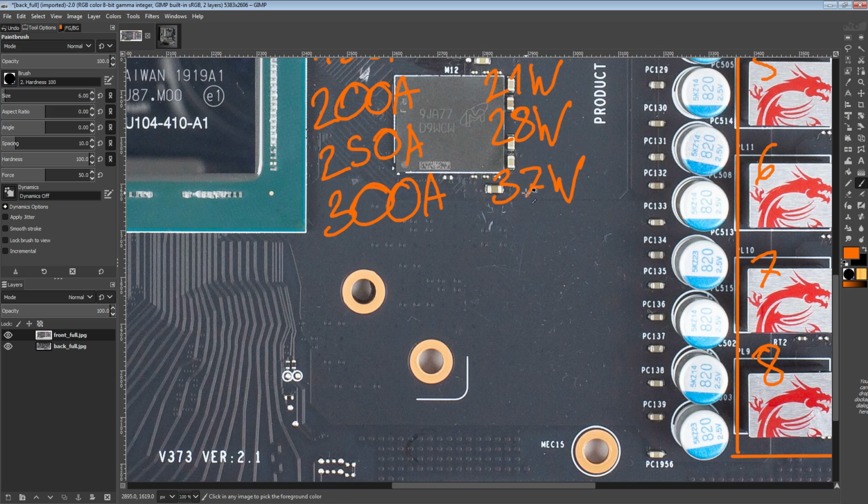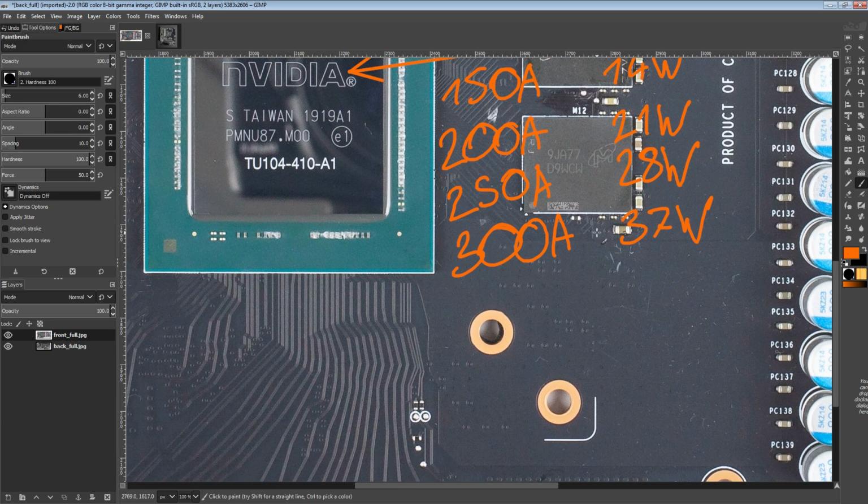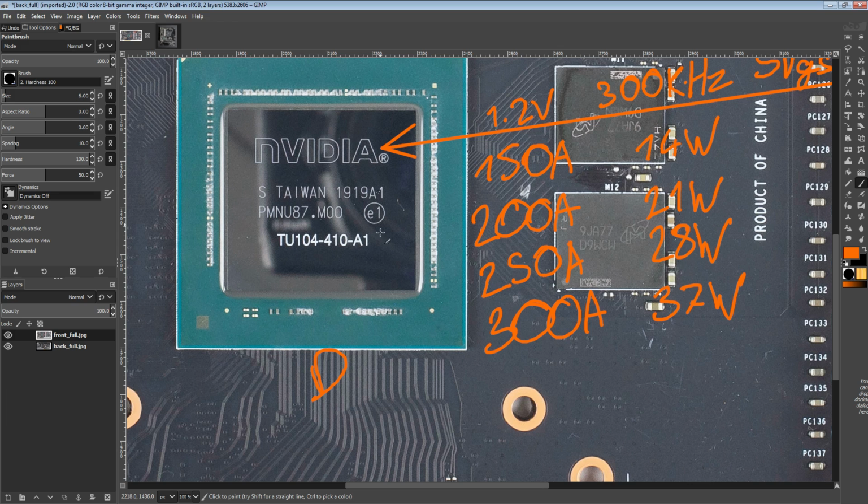It's just probably not doable without either a ridiculously huge passive heatsink or actual airflow over whatever heatsink you do have. Now, I'm pretty sure for 300 amps current draw on a 2070, you're looking at the very least dry ice levels of cooling, because at ambient temperatures, 2070s don't scale with voltage. One of the main power consumption drivers in GPUs, and really any semiconductor, is more voltage.